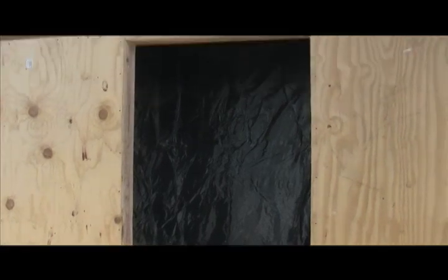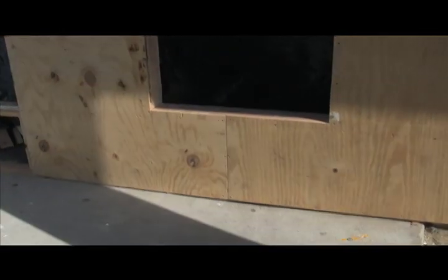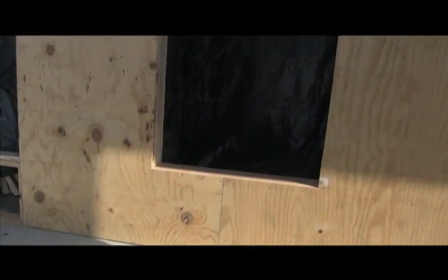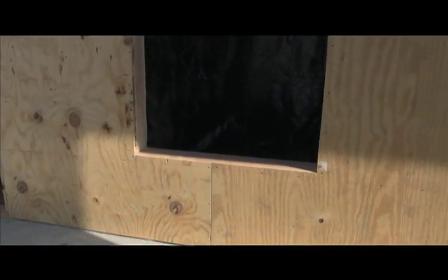This is going to be something of a West Coast installation. Tyvek house wrap or anybody's house wrap is not going to be used in this opening. We'll do another one of those in a future video because that's very important to learn. This installation is going to assume that a grade D building paper is going to be subsequently applied after this window is installed.